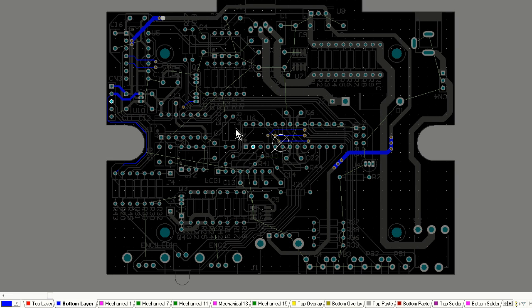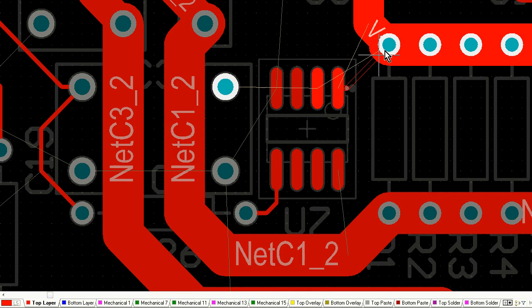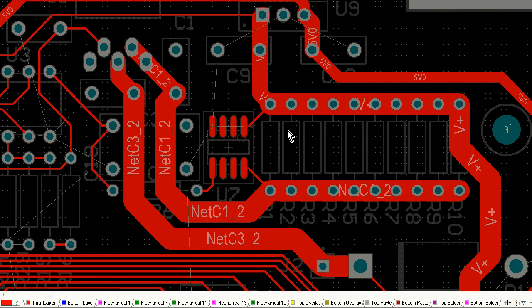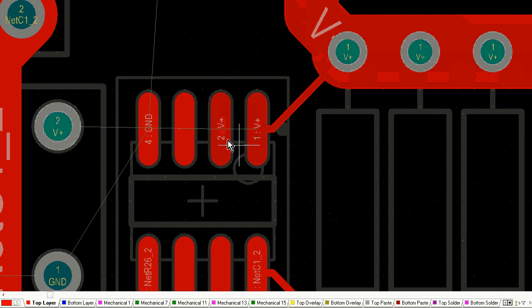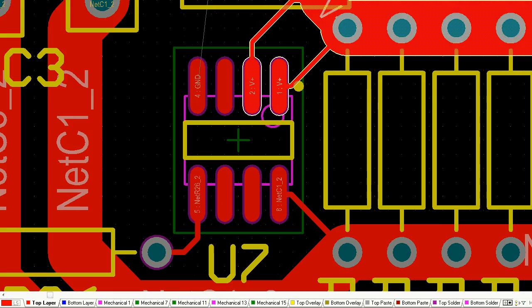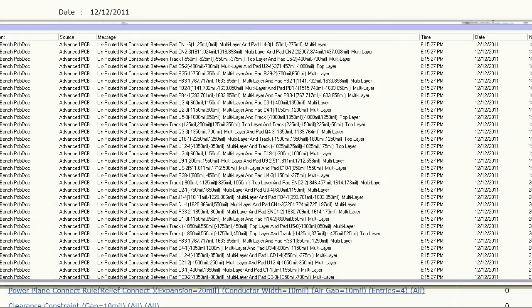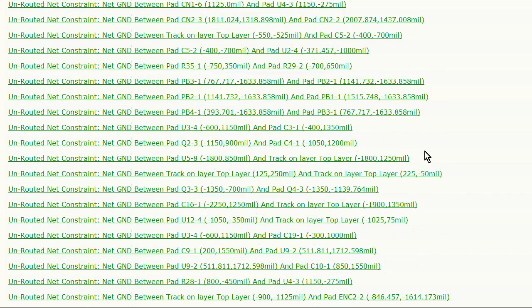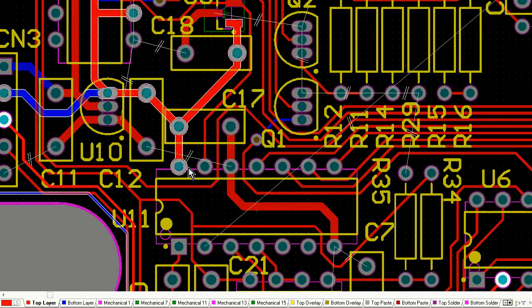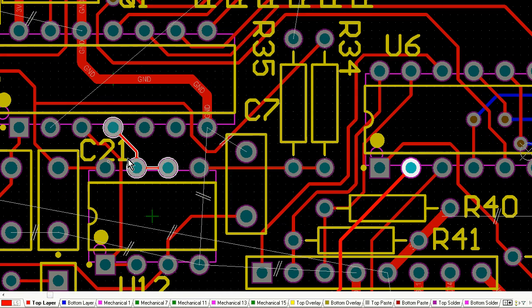And you'll notice that this board is really starting to come together now, and I'm probably at this point thinking to myself, I'm pretty darn pleased with this, and I don't think I actually have any or very few components left on the outside of the board to actually drag into here. So now I'm doing a bit more fine detail up there. I'm doing some bypass cap work up the top. I'm down into design rule checking. There you go. I have actually finished the basic layout. So I did a basic design rule check to find what the errors are. That will find